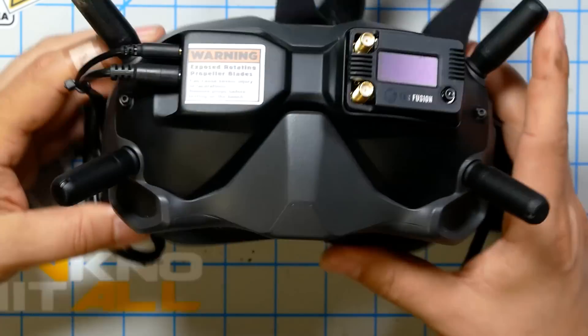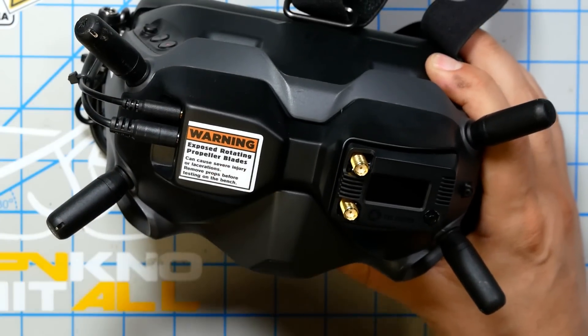That's where the British Drone Industries DigiAdapter comes in. I'm going to show you in a minute how this goes on — it is literally a two-screw install and it requires no major surgery on your goggles. Compare that to the iFlight mod I did on my channel earlier, where you have to literally tear the whole goggles apart to get in and solder to the power board.